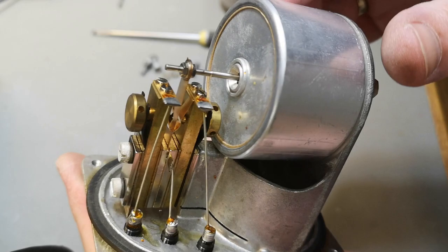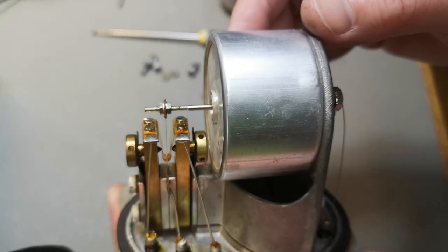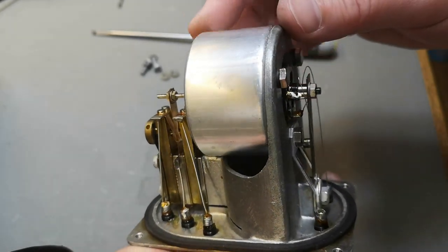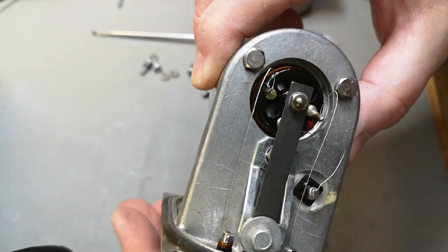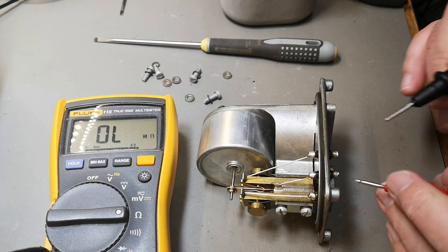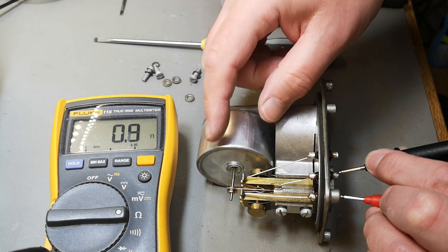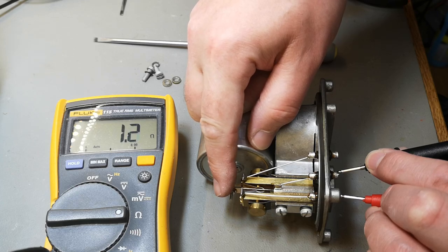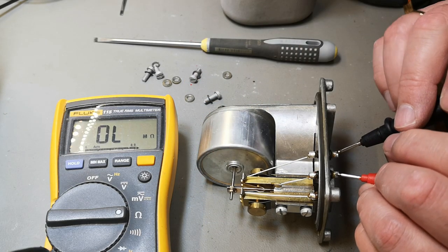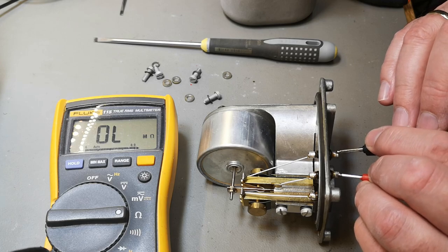Wow, that was really, really a find. And it is not really explained in the schematic — it just looks like a relay. Maybe I'll show you guys a snip of the schematic. And yes, I was right — this thing is just a relay. If I measure those two contacts, and if I just barely touch... move it — see, disconnect. And then I move the other two — there's no contact. It's difficult to get a connected condition.